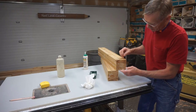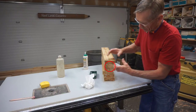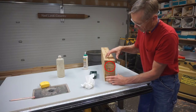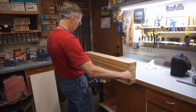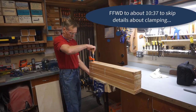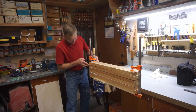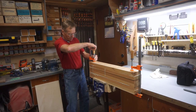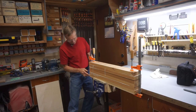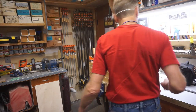I oriented the grain of these pieces so that when the finial is turned it has fine grain on the outside of the turning. I don't want a growth ring to be concentric with the outside of the finished turning because that would tend to make it flake off, so I've oriented the grain so that the finished product will have the surface I'm after. The whole thing ends up as kind of a slippery, gooey sandwich, but I keep flushing up the edges as the clamping pressure squeezes the glue out, adjusting the angle of the clamp so the pressure is straight together instead of going sideways.